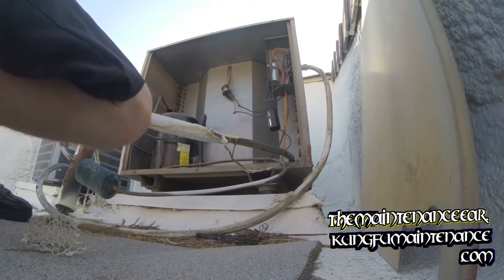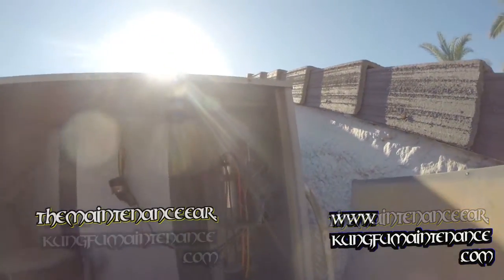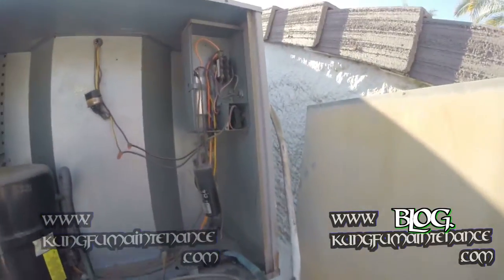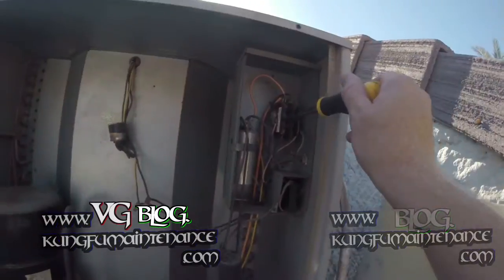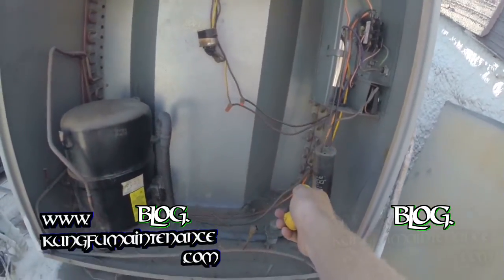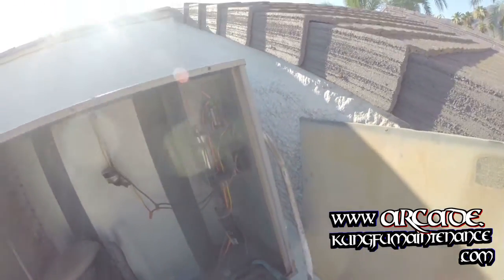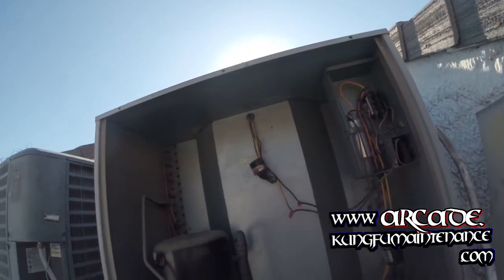Now, it's when the contactor's not sucked in. Or is it? It is sucked in, but the unit's not running. Let's take a look here. Contactor does not look too bad, but that is the suspect here. Are we getting voltage across the line? Now, our hard start kit's hanging, so we should secure that better. That fan cap looks pretty suspect, and also should mount it to the side here with some cable ties or some cable strapping instead.